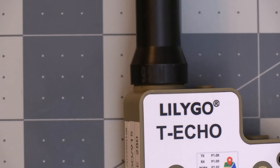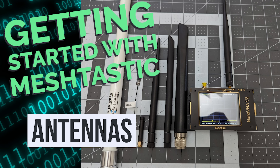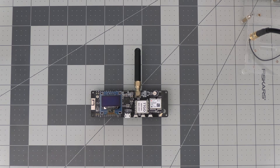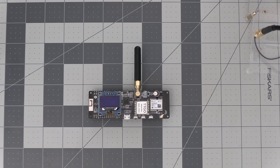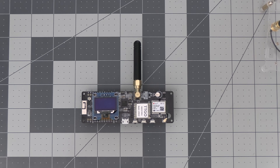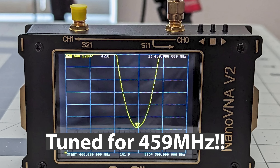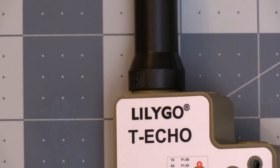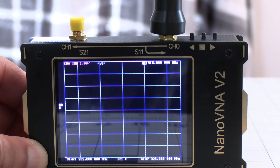Now let's have a look at the antenna. If you've seen my previous video on antennas for the Getting Started with Meshtastic series, you'll know that the antennas that come with other LilyGo products like the T-Beam are not very good, and I highly recommend upgrading from the stock antenna on those. With the 915 MHz T-Beam, the antenna seemed to be tuned closer to the 433 MHz range, so they may have been using a single antenna for all their devices. The T-Echo's antenna does have 915 MHz printed on it, so that is promising. Let's throw it on the Nano VNA and see what we get.